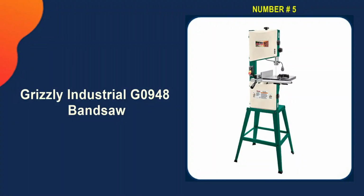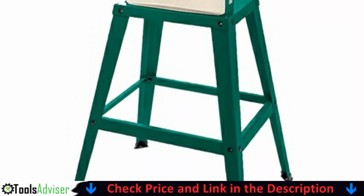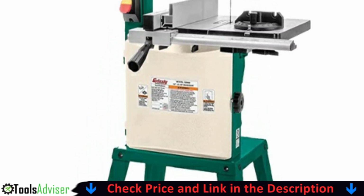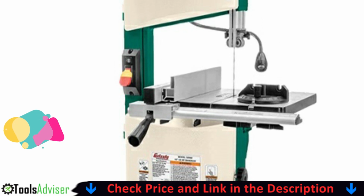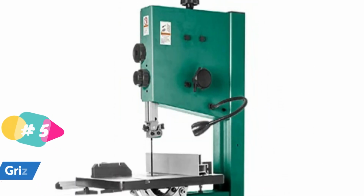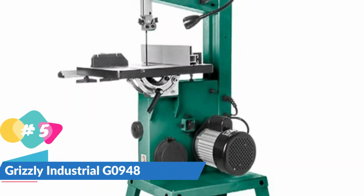Last in our best 10-inch bandsaw list is the Grizzly Industrial G0948 bandsaw. The feature-packed lightweight G0948 10-inch half HP bandsaw is a perfect entry-level machine for home or garage setups, or as an easy-to-move auxiliary saw for professional shops. With a maximum cutting height of 6 1/8 inches, you'll have as much resaw capacity as some 14-inch models.